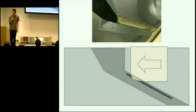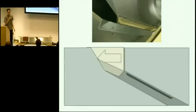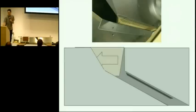So the way the machine is actually shaped is a bit more like this. There's a diagonal opening near the bottom, and then the opening opens up vertically in the top part. So as the book is going across, the page gets suctioned against that dark area and curves around that diagonal. But at some point, the page reaches the part where this opening opens up vertically. And so the page is no longer supported by the surface that's on the right. So it's actually free to swing across to the other side. So if you have a shape like this, then the page can basically slide its way off of that vacuum section without applying too much force to the binding.